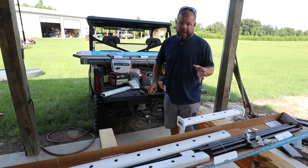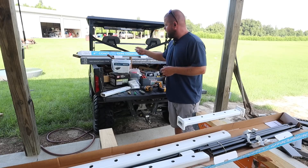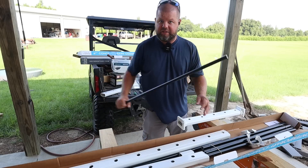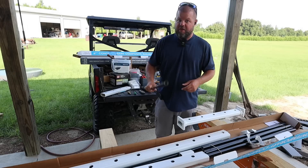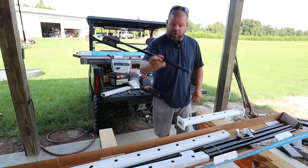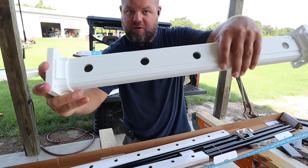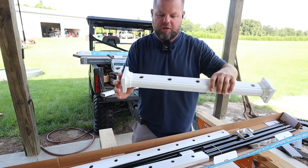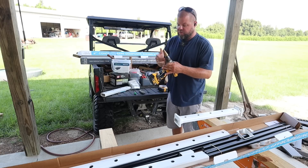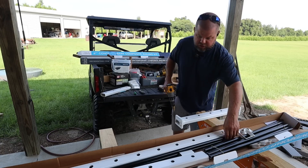Well, as often is the case, you get what you pay for. These Decorator grab-and-go rail kits from Lowe's — I think I'd recommend you spend more money and get a better rail kit. The first issue I had was I could never find them in stock and had to travel to three different stores. Then I kept finding missing hardware components out of the box — it took forever to find enough complete boxes to do my job. Now I'm finding the aluminum balusters that are supposed to go in the pre-drilled holes from the factory won't even fit. So now I'm having to drill out all the holes — and somebody was having a really bad day at the factory because the holes are oblong. While I saved good money, I've lost time having to do all the running around, find the hardware packets, and drill out all the holes that should have been done correctly from the factory.